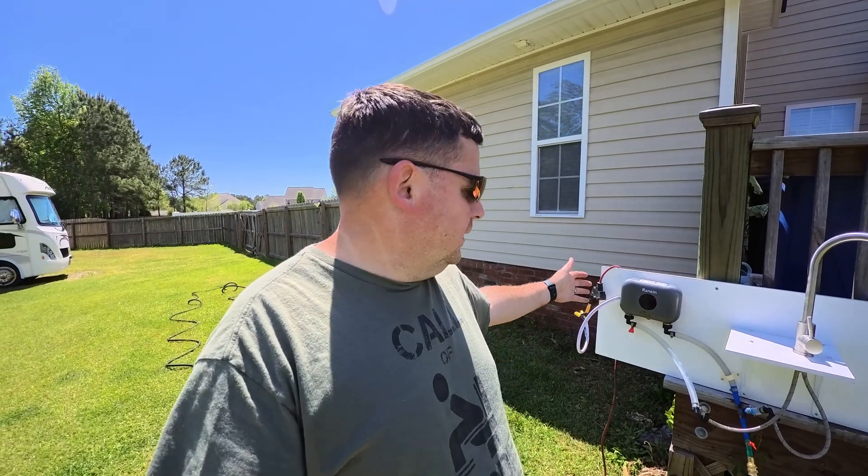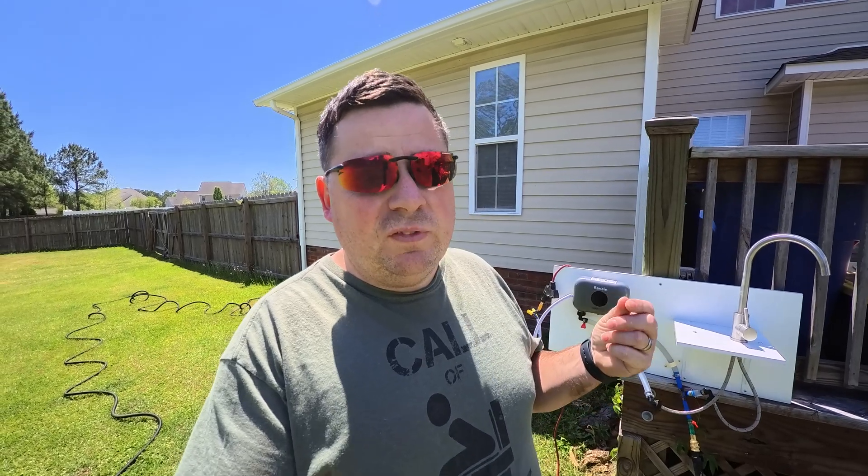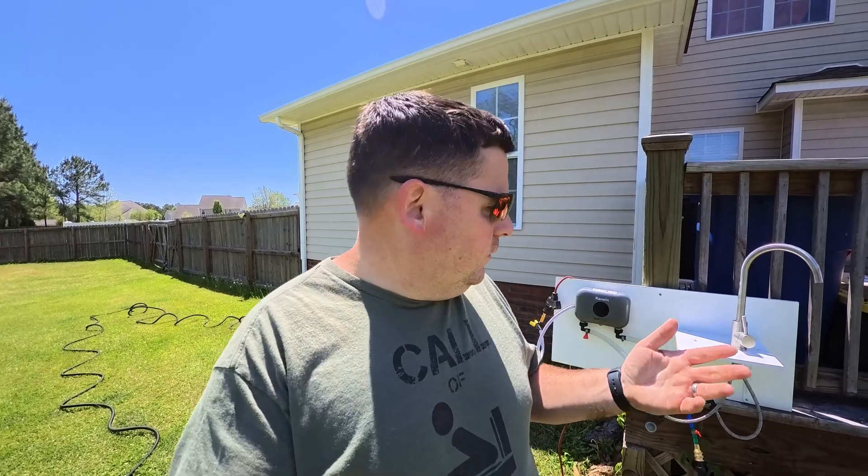That's the review. That's the use case — just not mine. I'll have to look for a smaller tankless unit to put underneath. Thanks for watching — if you're looking for one of these, just know that anything over 1500 watts you're going to have a hard time finding an outlet in your house to plug it into. Higher than that, you'd need a 30-amp breaker, but you're running other big appliances off those. You also have to have heavy-gauge wire, which is another problem.